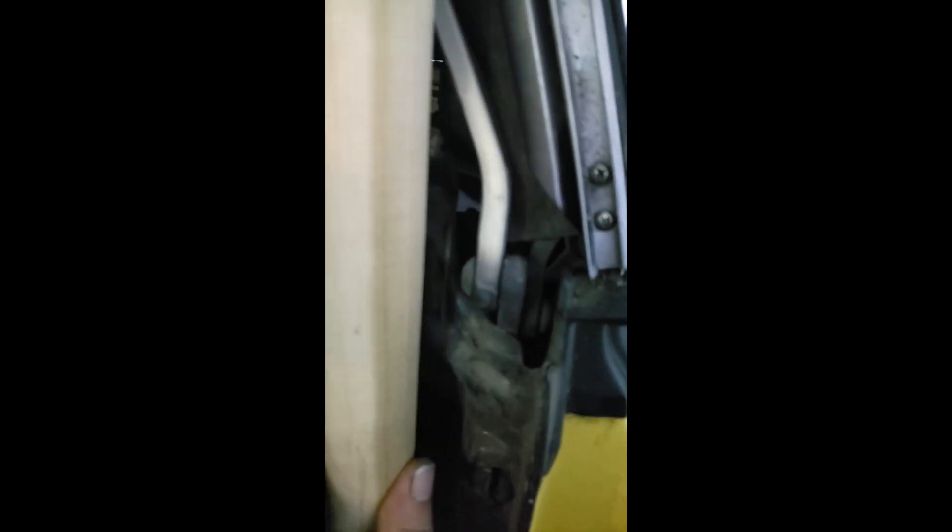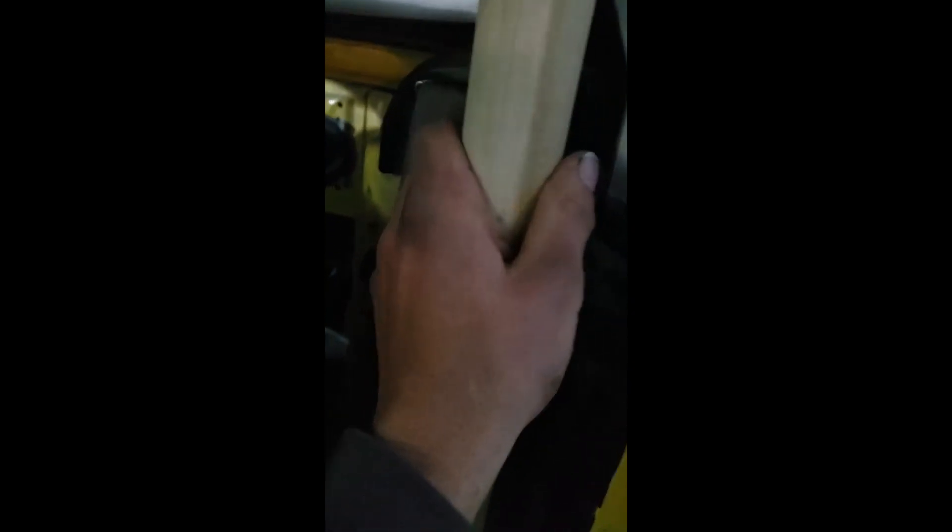We've got my top bar in place, just held in place with some tape. I'm going down here and see where that seat belt brace is — that's going to be my outside. I'm going to go from there, notch it, trim it. Let's cut that up. I'm going to cut it right here to make sure I'm nowhere near the seat belt mechanism so it won't rub.